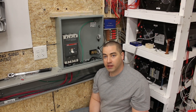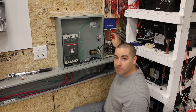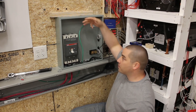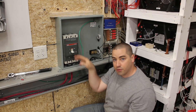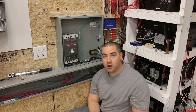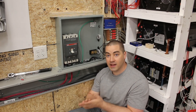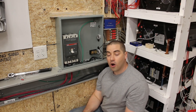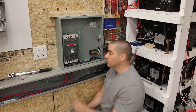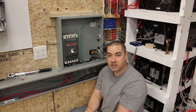What I was originally planning on doing was taking three wires from the positive bus bar up into the breaker and have three outputs. Two of the outputs would go to each inverter, and one of them was going to go to the charge controller. That way I could shut everything off — the charging and the load drawing — all in one shot, which would be really great. Have the BMS just control this, and everything gets killed all at once.